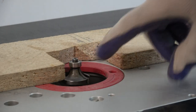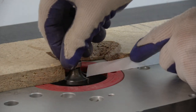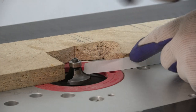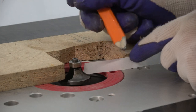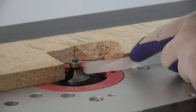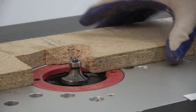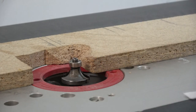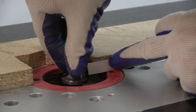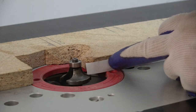If I put it on this side here, assume that this piece of paper is the bit of timber. It comes through there, hits the cutter, and then pulls it back. Now, if this timber was to splinter and break, as it often does, it's going to break all the way back to this point here. That's terrible. That can actually destroy your project, because it can run inside your finished piece area. So what you want to do is bring this right up to the tip, to use this part of the fence as a chip breaker. No different to the infeed table of a jointer, or the chip breakers inside a thicknesser. So now when it comes through there, if it was a splinter, it can only splinter out a quarter of an inch. It's a much better way of doing it.